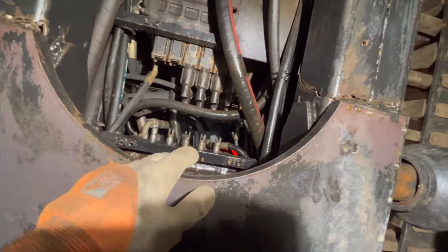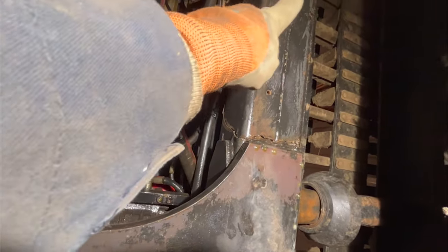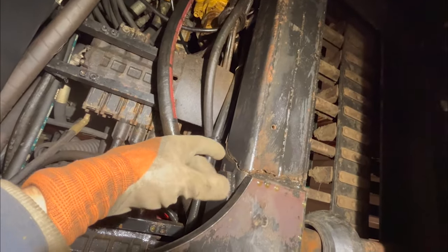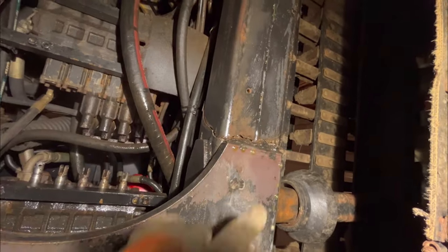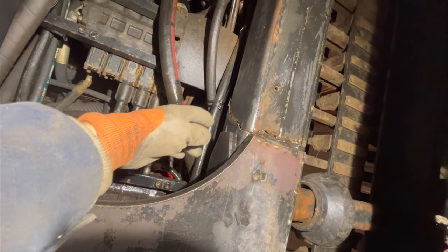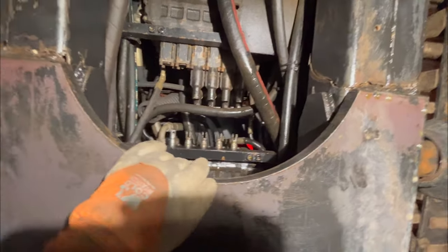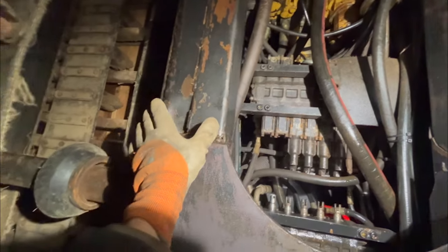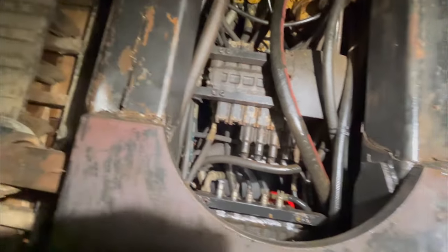What we're going to do is put a piece of one-inch here that goes down, weld that on, and then weld a piece of three-eighths across this. And we're also going to weld another piece up there to brace it that way — on both sides. It's eight plates that I cut on a water jet, and it's going to be a lot of work.